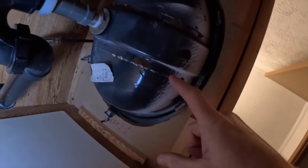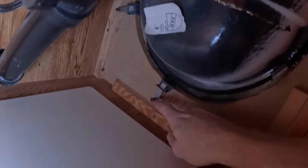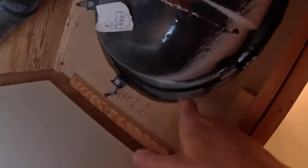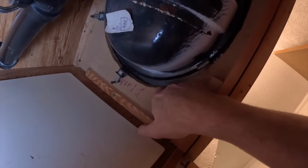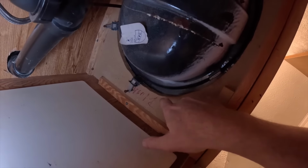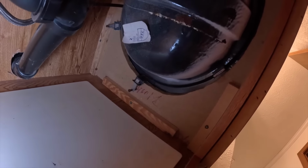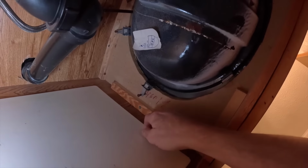All right, so here's how my sink is installed. I have 6 of these clips. Actually, I'm missing 3 of them. These little screws right here fell out. I don't think, oh, there is plumber's putty underneath. So hopefully that will come off decently. I'm going to remove this and then put silicone down to hold mine in place. We're not going to use these clips.